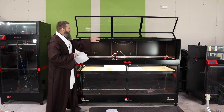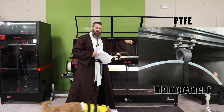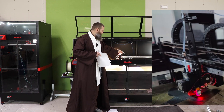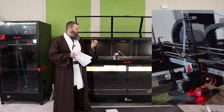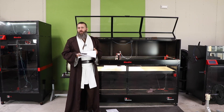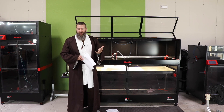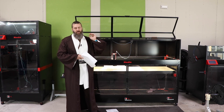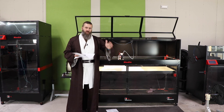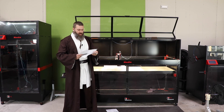They are also improving the PTFE management. One aspect is the little roller carriage currently equipped on some of the larger machines. Another thing is they're actually going to have a pneumatic coupling — essentially a pneumatic bracket — that will sit at the top and hold the end of the PTFE tubing. They used to include an extra-long piece of PTFE so you could cut it to length to match your machine. A lot of people weren't cutting them to length. They're now going to make sure they're always cut to the appropriate size — no thinking about where to cut it, and no fear of cutting it too short.